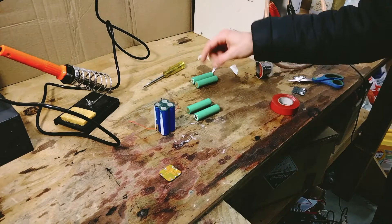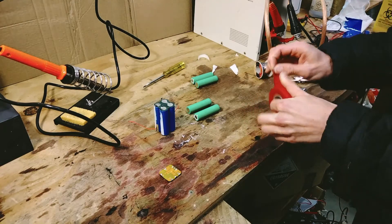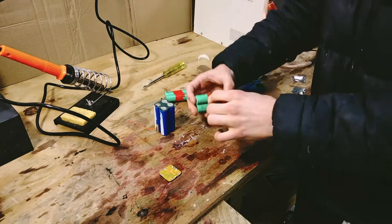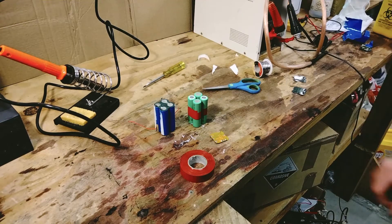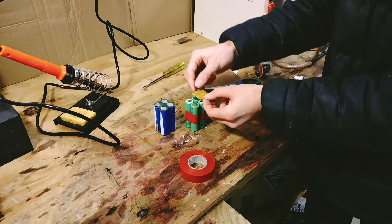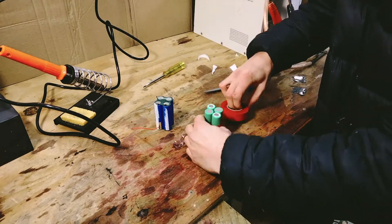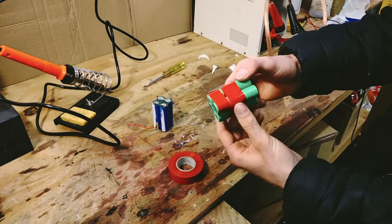It's really hard to wrap four cells at a time with tape, so I'm going to do two at a time and then wrap the sets of two together. We've got our two packs now and we'll take these together. Note the orientation — battery plus has to match up with the battery plus terminal so the BMS can sit correctly. I'm going to get the silicone tape. Batteries are all together now — we'll actually put some good heat shrink on here so it'll look professional.